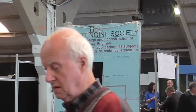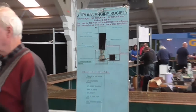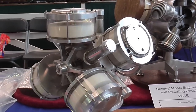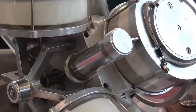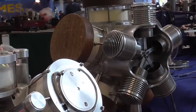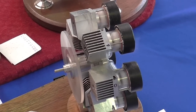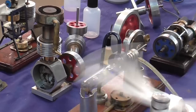There is also a fairly large section on aeroplanes. Here we have the Stirling Engine Society, and there is a diagram showing how a Stirling engine works. They have all kinds of things powered by Stirling engines. The white things you see popping in and out are the displacement pistons, and the small aluminium one in the middle is the power piston. There's something you'd call a radial Stirling engine, and another form of radial Stirling engine where the displacement piston pops in and out perpendicular to the power piston. You can see through the helicopter rotor — there's an interesting engine using marbles as the displacement.